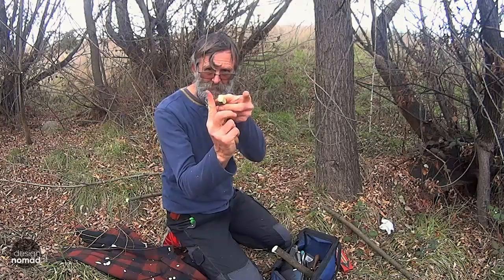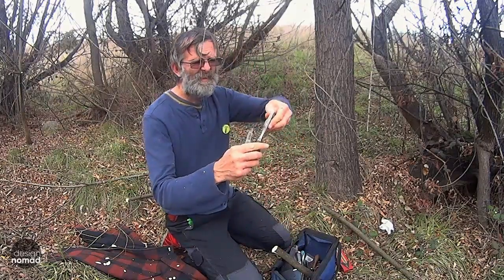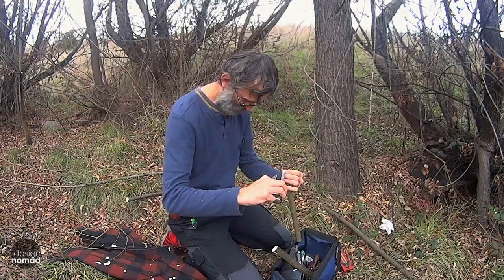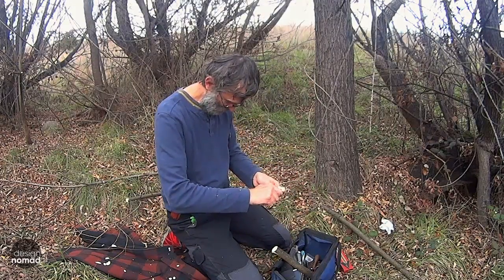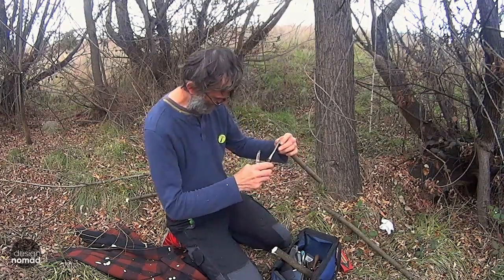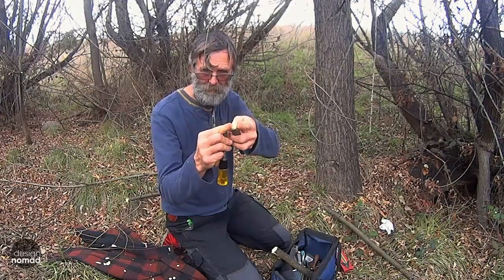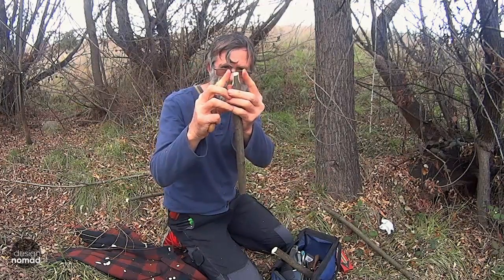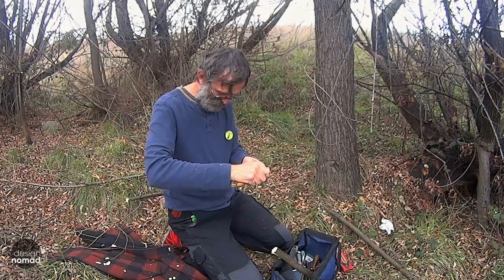Now if you see that, that's a little bit wide at this end. I'm going to bring that down just a bit more towards the width of my chisel. Width of my chisel, parallel faces, it's the beginning of a tenon. Now it swoops out like this a little bit. That won't be a problem in this particular joint, but we might just pare that down just a little bit.